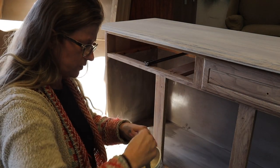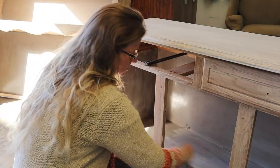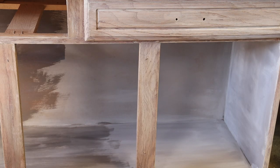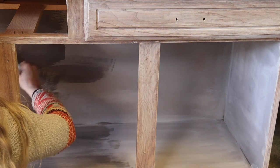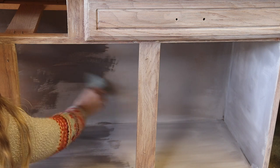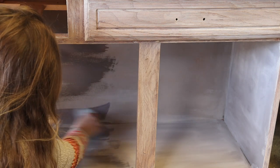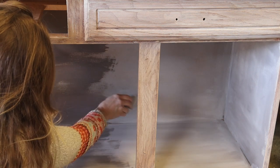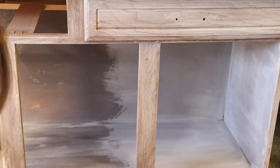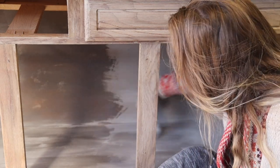On the parts of the raw wood, I already knew some tannins were showing up. I don't know where my head was — when you put top coat on, it's drawing the tannins up out of the wood. I'm alright to seal on the inside because I didn't sand back to bare wood. I just scuff sanded and painted over it, so there's a barrier between the tannins and the top coat.